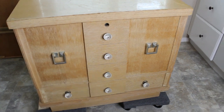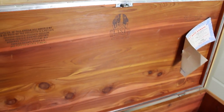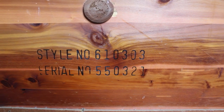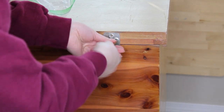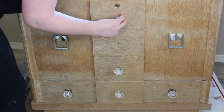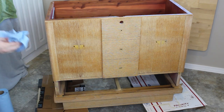So this is the piece we're working on today: a 1955 mid-century modern Lane cedar chest. Lane actually recalled all the locks on their cedar chests from 1912 to 1987, and they will send you a replacement free of charge — just fill out the form through their website link, which I'll put in the description. The way you can tell how old your cedar chest is: the serial number is actually the manufacture date in reverse, so mine is December 30th, 1955. I decided I'm going to sand down the top, remove the hardware to reuse some of it, and clean the entire piece inside and out with TSP substitute. When cleaning raw cedar, just use mild soapy water — do not use TSP on the inside.